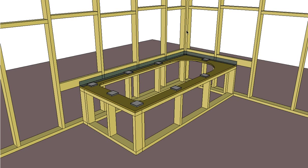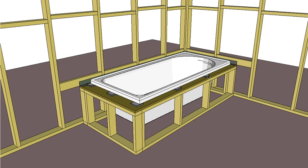You could also put some down that corner as well just in case. So the bath goes in sitting on the packers so that when the tiler comes along, the chippy can put the villa board in and the tiler can get the tiles under the lip of the bath. The other thing is, depending on the type of bath — whether it's fibreglass or a pressed metal bath — you are going to need to put something under the bath just to stop it from flexing. Traditionally what they used was a sand cement mortar mix.